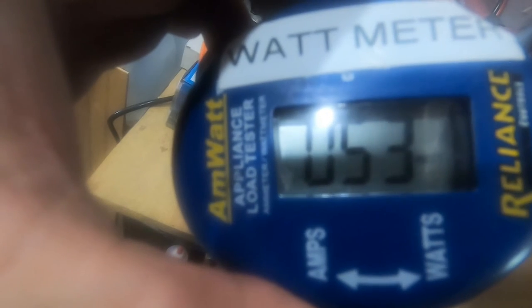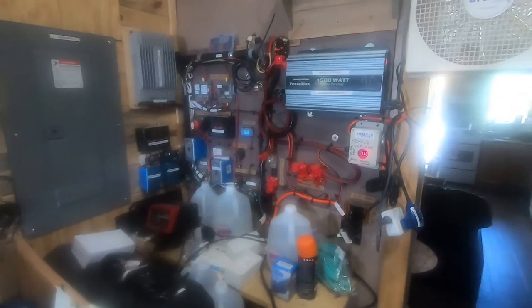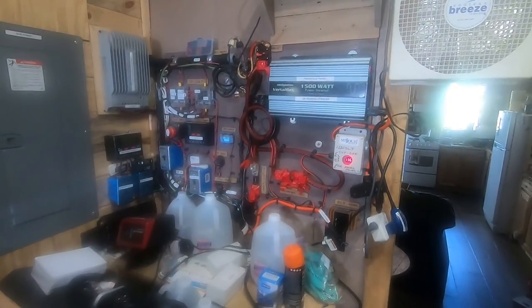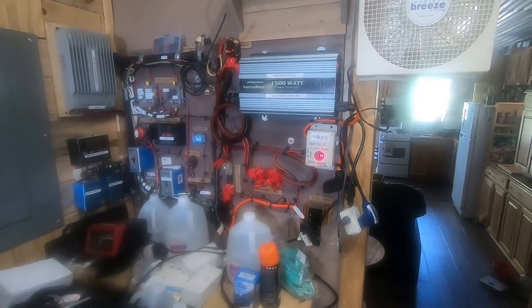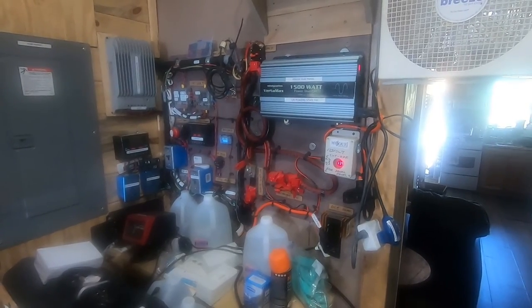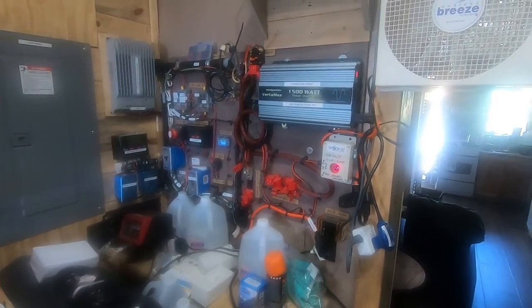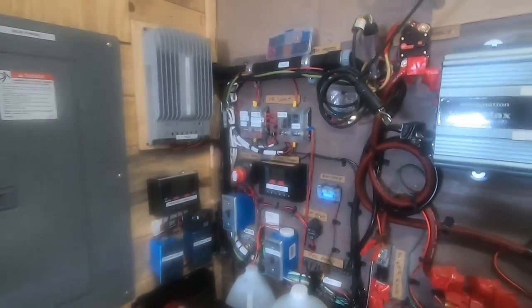Here's why — can you read that? That's the wattage needed for that satellite dish. It takes a lot of power. 50 watts — that's not much unless you're living off-grid, and there's no sense hammering this battery bank at night when I'm sleeping and not needing the internet. It takes five minutes in the morning for the system to boot up and it's off and running. I'm using a pure sine wave inverter — I love Windy Nation, not sponsored. I've got eight Walmart batteries for this system so far, and it's working really good. I keep them topped off with water and check the acid level.